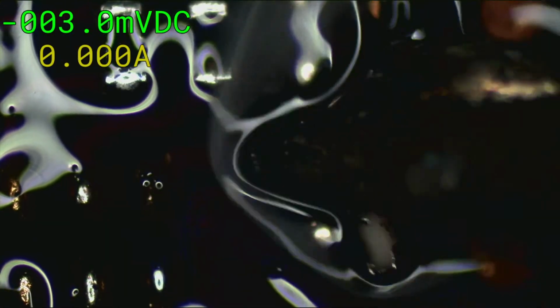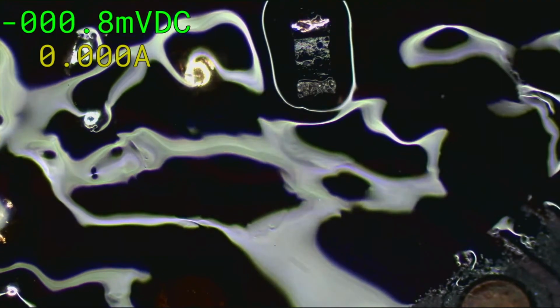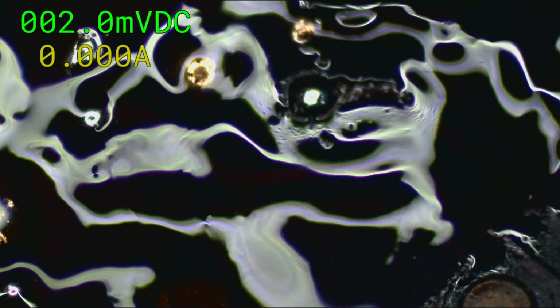If they won't take fresh solder, then you get rid of them, put new ones on. But if the solder joints brighten back up, nope, that one's not taking fresh solder, that one's gone. That one as well, gone. That one as well, gone. They wouldn't brighten up, they go.